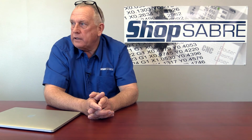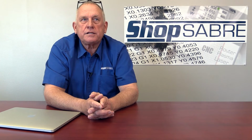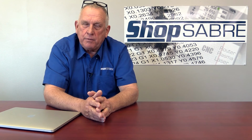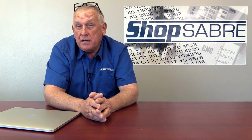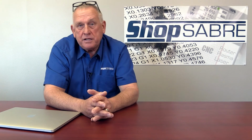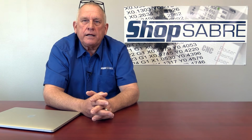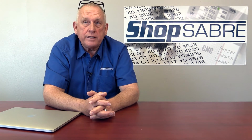All right, now, what did the machine time really cost? Well, let's unpack that a little bit. Let's say if you take a machine tool grade American-made router like a ShopSabre, it's probably got a useful life of 20 years, and maybe even more than that, because technically anything that wears out is replaceable. But let's just say for easy numbers, let's say 20 years. Okay, let's say that I'm going to work 5 days a week, 8 hours a day, 50 weeks a year.